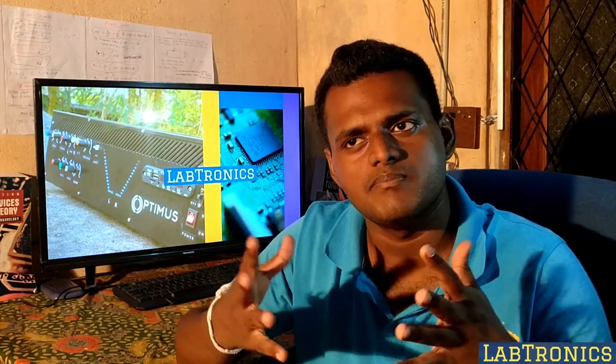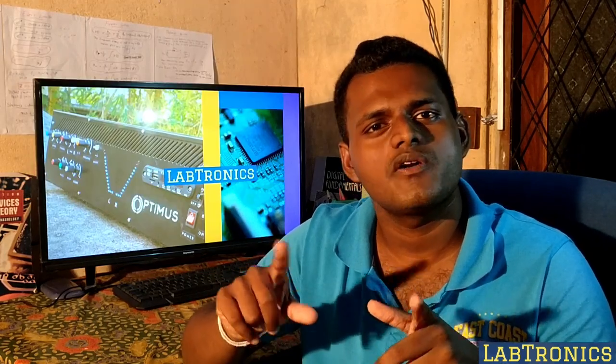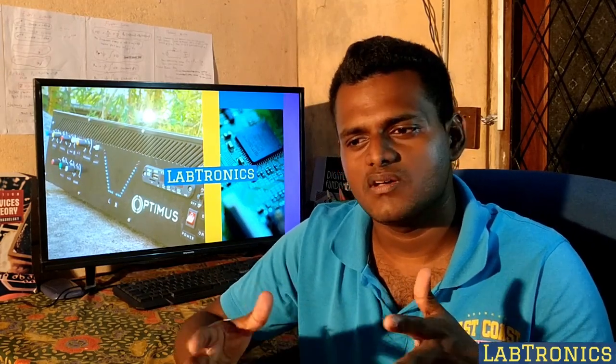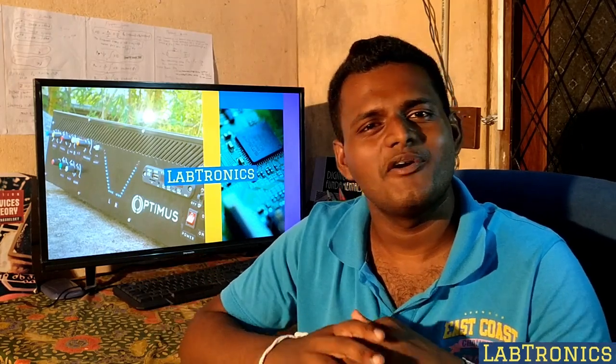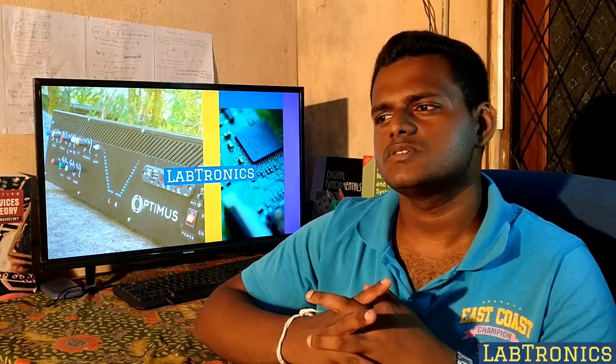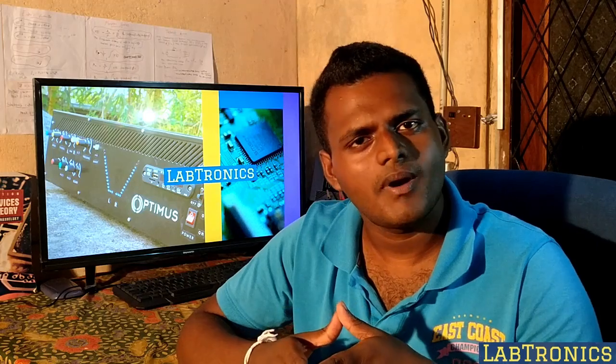The second video I am trying to design is a dual supply bench — a bench power supply with dual voltage, meaning a dual power supply. I am trying to design 30 volts — meaning plus VCC and minus VCC with ground. I am trying to make it with 5 Ampere output, powerful and very accurate. I hope to add many features for that project, because I am trying to make it a tough power supply.